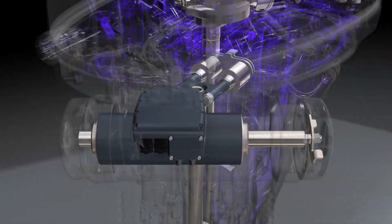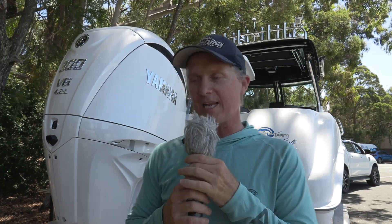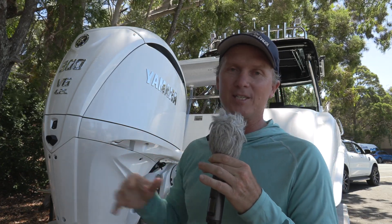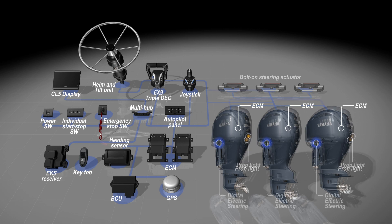That's a pretty good-looking montage of a good-looking boat and an even better-looking outboard out on Moreton Bay. For us, it was all about comparing this version of the Yamaha 300 with the old F300, which is such a workhorse and has been around for many years. It's all about the integration - this motor has the built-in DES digital electric steering, and it plugs into everything else digitally at the helm. You bolt this motor on the back, connect the fuel and the battery and the control wires, and it talks to your digital helm. You've got a standard throttle, except you've got digital shift, which means it's really smooth - forward, reverse, no clunking into gear, no grinding the teeth like in the old days. And if you want to up the ante with the Yamaha Helm Master EX system, you can plug in the joystick and the autopilot, and all of it works seamlessly together.